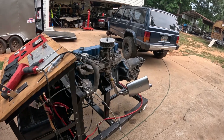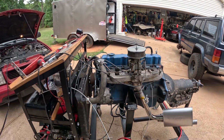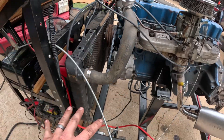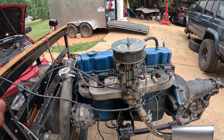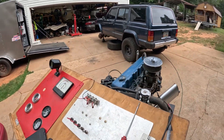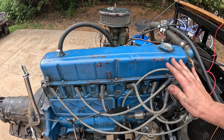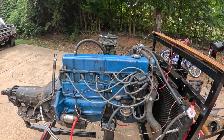The engine is all out here and I've been cleaning up — you can see where we've got a lot of transmission fluid. I've been having a hard time getting this engine running. We've got a little fuel leak we're about to seal up, and I hit the radiator putting the front back on so there's a little dribble there. It was running for a while, but as soon as I gave it any throttle it died. I double-checked my firing order and I had it totally wrong — I had like three wires in the wrong spot.